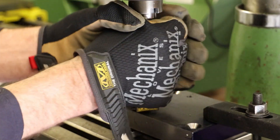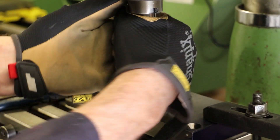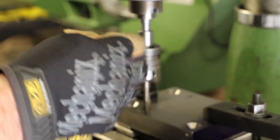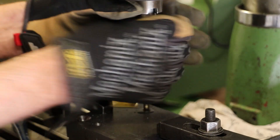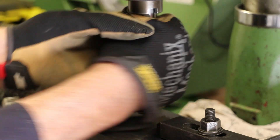This chuck will actually struggle to hold that tap, but this is just to get me started. I do see some people run their tap straight through under power, something that I'm really not keen on. I'd hate to break a tap at this stage with all the work I've put into this plate. I'm doing roughly a quarter to a third of a turn cutting and then backing off to break the burr.